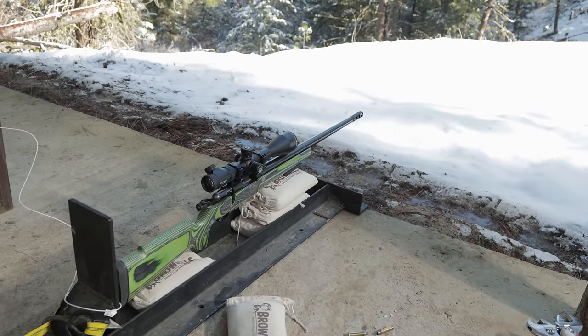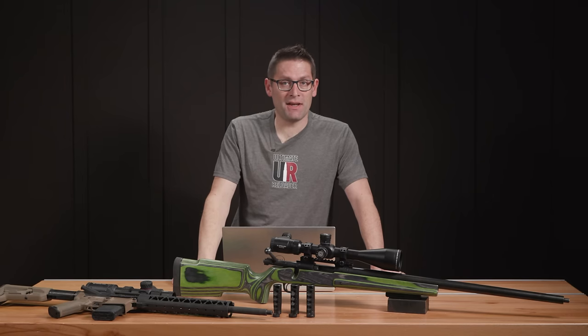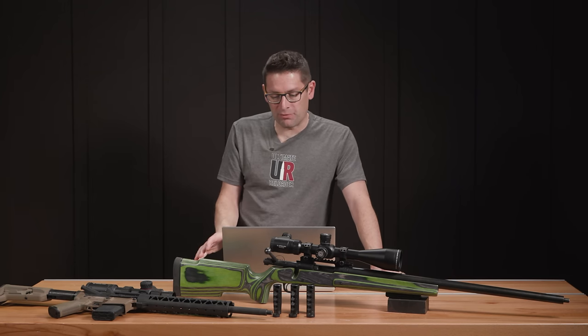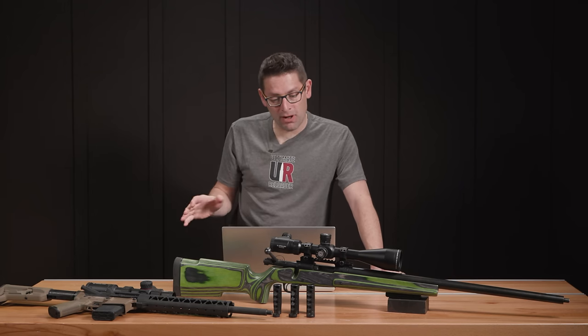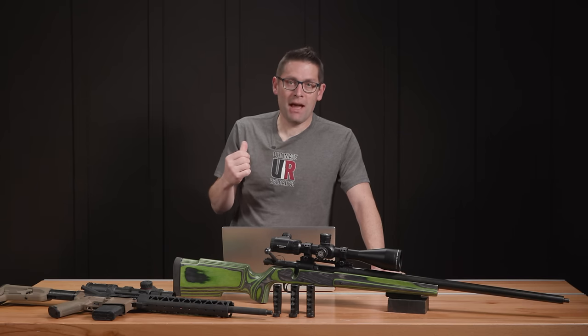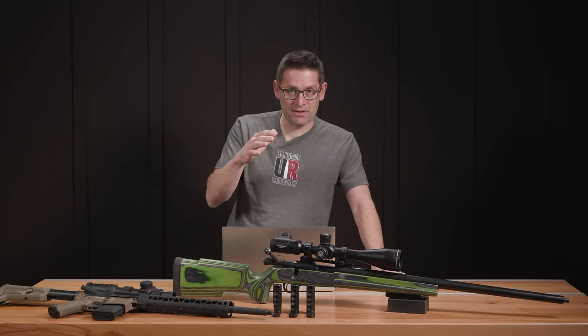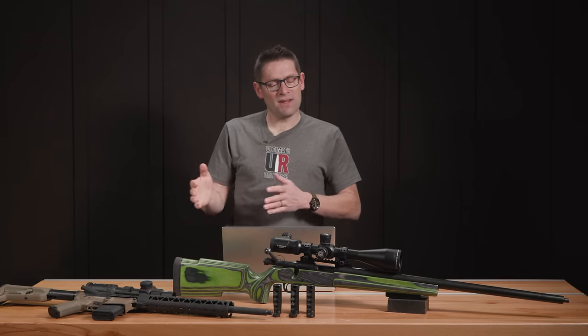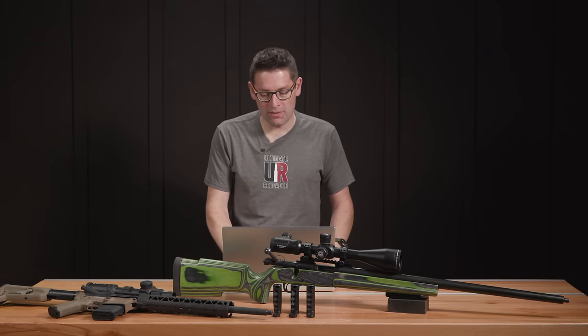A little bit about the Ultimate Reloader recoil rig. This was based on a design that Calzant over at the Precision Rifle Blog published — we've made it our own. We've welded up a steel frame and written custom software. This recoil rig is really cool because it can measure and capture force readings in pounds at 20,000 force readings per second. That gives us a nice smooth plot of recoil, and we can tell a lot about what's happening: peak forces, total impulse, any kind of resonance and vibration — it all shows up on the graphs.